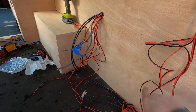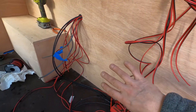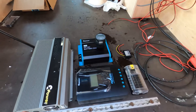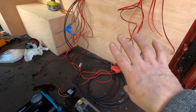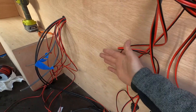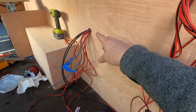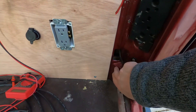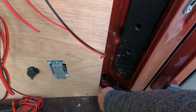Hopefully, once I get it set up I won't even have to think about it for the next 10 years. I'm going to block this out with some 2x2s, so I have almost like a fake wall here where a lot of these wires will be organized and tucked back in. We'll have a couple of holes coming out in the right places of that board so that everything looks really, really clean on the outside — we don't see a big cluster of wires. I am going to put a ground back here somewhere on this panel so we do have an earth ground on the chassis of the vehicle.